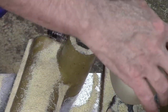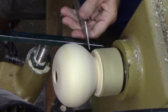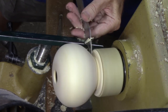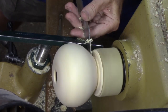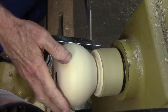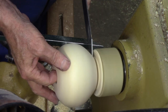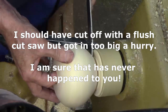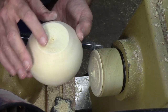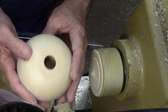From here all we've got to do is a little sanding and then we'll part it off. I'll do the sanding off-camera. We're going to go ahead and part this off very carefully using a thin narrow parting tool, trying to come in slightly concave. There's our form. I'm going to sand the bottom on the drill press with a mandrel, and then I'll decide what kind of finish to put on it. Thanks for watching.